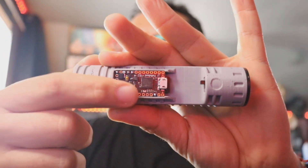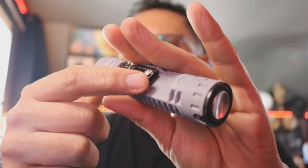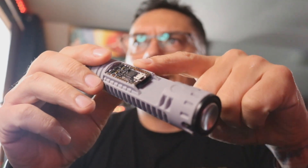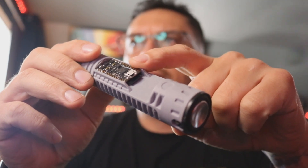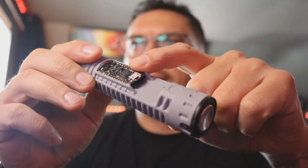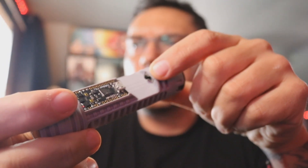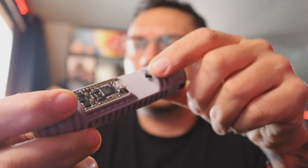This is your chassis. You've got now a Profi board with easy access to your SD card and your micro USB. You've got one sound font on here for now — it's my sound font — and there's a copy of the config file that I used on your SD card, so you can take that and make changes. This is set up for a one-blade style type of setup, so all three of your blades are basically one blade style on this one. Right in front of the board, you've got a kill switch, so you can leave your battery in here, take the chassis out, and flip your switch.